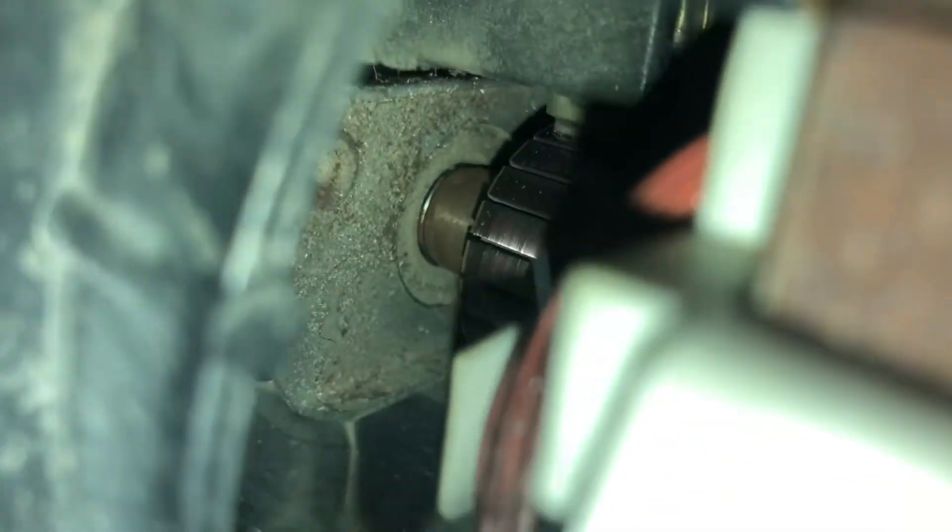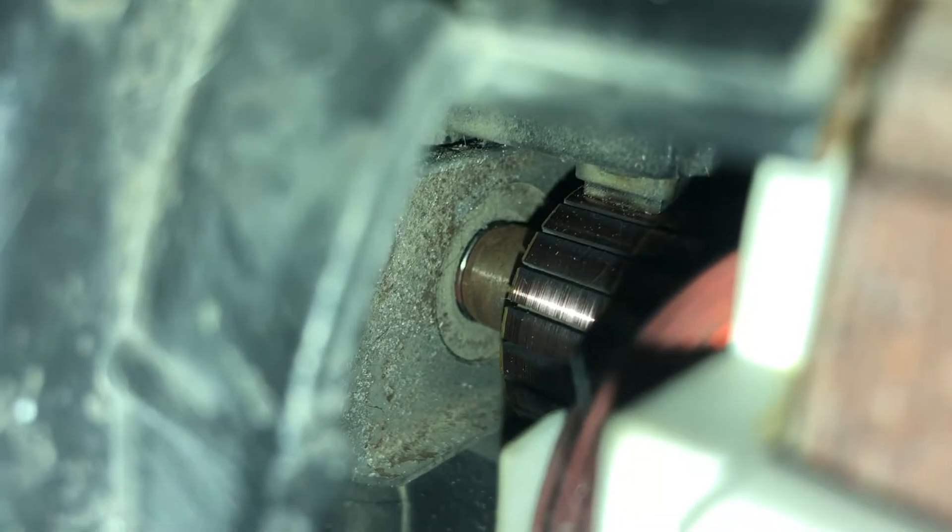That hair isn't mine — I don't have anything with hair that looks like this. There's a lot of rust on the motor. The armature looks good, commutator looks passable. I can actually drop some oil in the other bearing there. If I can just reach my oil thing in there — this bearing I'm gonna grease because I can actually get it apart.